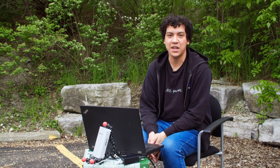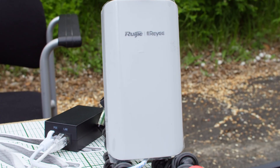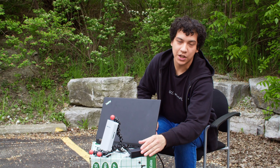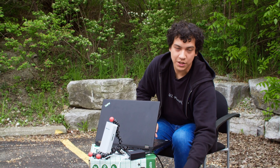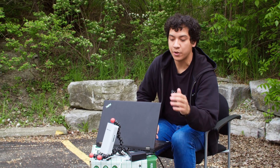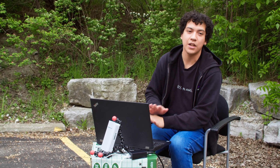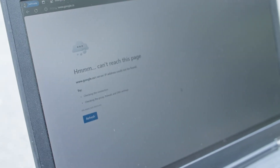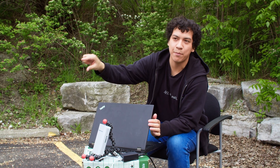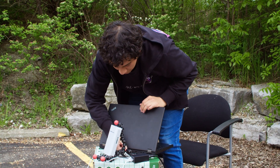We made it to the other side of the plaza and I have set up the transmitter side of the wireless bridge, which is plugged into the PoE injector giving it power. The PoE injector is getting power from this Uniview portable battery, so that's what's allowing us to power up the whole setup. I brought my laptop out here and right now I don't have any internet on my laptop — nothing, no internet. The wireless bridge should be linked up back to the office, so we should have an internet connection if I plug my laptop into the bridge.